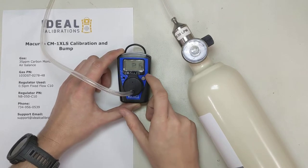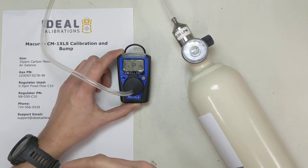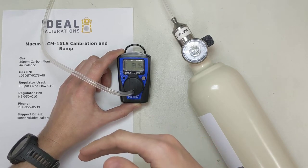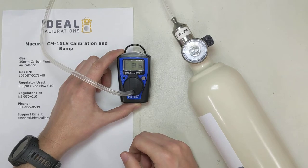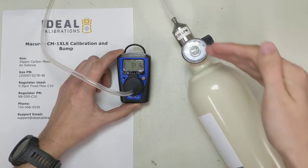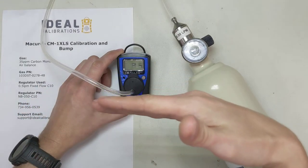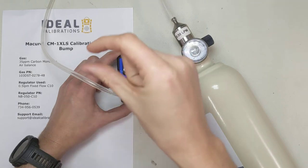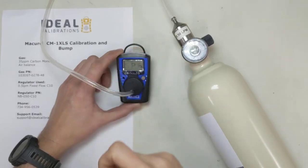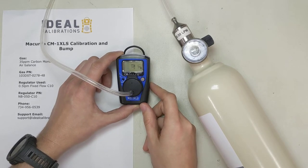What this is doing is the full calibration — so instead of just that T90 time, it's taking it up to 100%, or as close as it can get. The closer you get to 100%, the more it slows down — you hit a point of diminishing returns. It's waiting until that sensor response stabilizes, which is why they make it about 2 to 3 minutes. Some gas detector manufacturers take that T90 time and use an algorithm to determine when it's going to hit 100. This one takes a little bit longer and doesn't behave that same way.